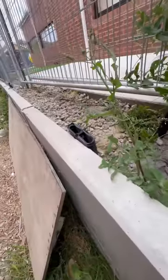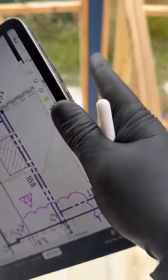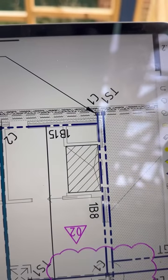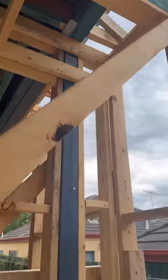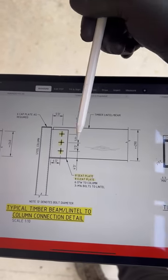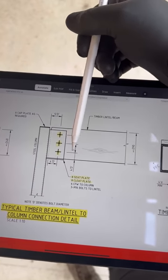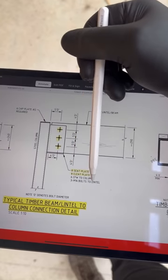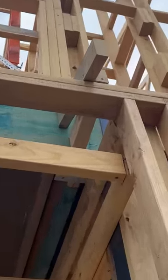We've got a C1 right there and it's carrying 1B15, which is a double beam right there. That means there should be a connection from the steel column to a timber beam. The engineering drawing shows the beam butting into the steel column — there's supposed to be a seat for the beam to sit on, and also a cleat with three M16 bolts to the lintel. But looking at this steel column and beam, there is nothing. It is just simply sitting there.